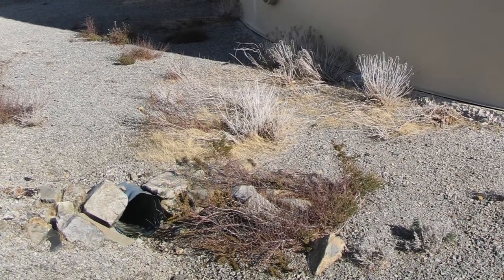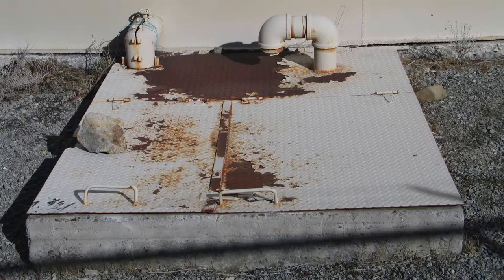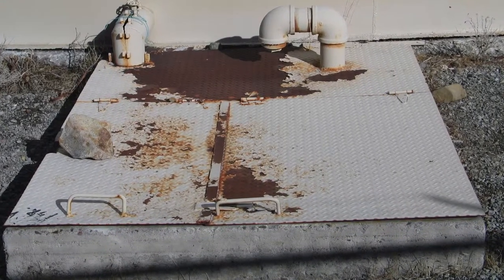We're doing a little bit of site work to improve the grading, and improving some of the other appurtenances. We have an existing vault on the outside that we're going to remove and replace because it's in very bad shape. We're also adding a pressure transducer into the new vault so we can automate the pressure readings and get more reliable readings.